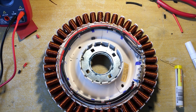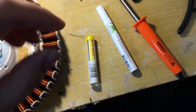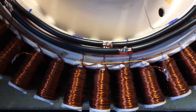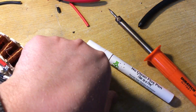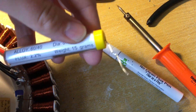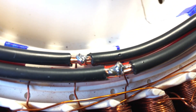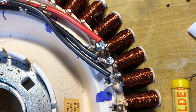I've just finished soldering and there's a lot there. I've been using a flux pen — making the connection, wrapping the wire around, then adding flux, heating it up with the tip, and then introducing some rosin core solder. You want it to melt around and still be able to see the wire through it. These big connections are horrible — hopefully you can do better than I did.